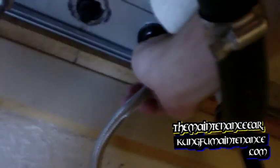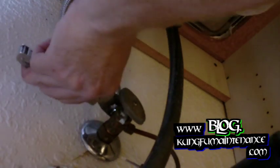Okay. Got the water turned off, and then I'm going to remove the gloves and we're going to field test for any leaks at all of the fittings. Starting here, we're going to feel around the fittings. See, I have a little moisture there. Yeah, we got a tiny bit of moisture there. Checking up top, we're dry up top here. Everything's good there, but definitely got just a tiny bit of moisture here. I'm going to tighten this up just a little bit more. No big deal. Okay, and we'll retest it.